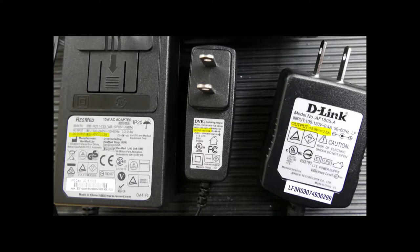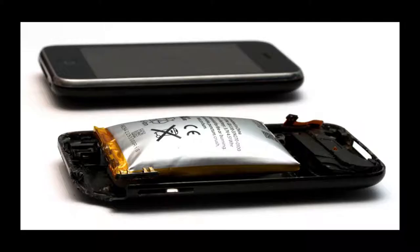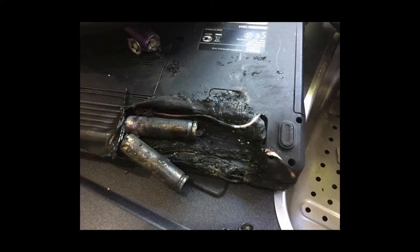Some external power supplies are designed to deliver a constant output voltage at a rated current, while charger adapters are designed for charging batteries and use the detected output voltage as feedback to control the output of the charger, which prevents batteries from being overcharged. If a power supply is used as a makeshift charger, it will continue charging the battery until the battery catches fire or it explodes.